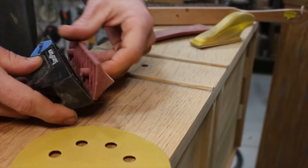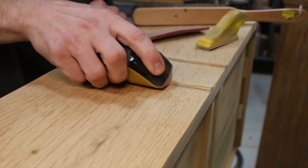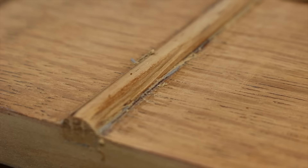At this point, there are still some imperfections in the wood. I've only used 150 grit sandpaper. I'll finish this process by sanding with 220 grit sandpaper in preparation for the stain. Sanding some of the detailed areas may require sanding against the wood grain, so I'll finish by sanding in the direction of the wood grain.